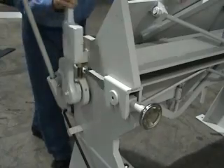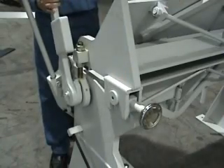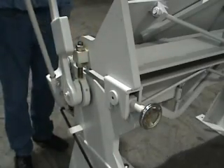You bring it in, and when you go back to bend again, that bar is going to hit on the pass-through and stop it at 97 degrees. So here it comes — it comes through, hits the position, and goes back home.